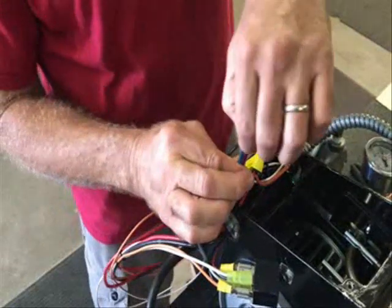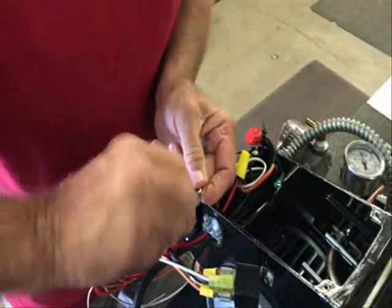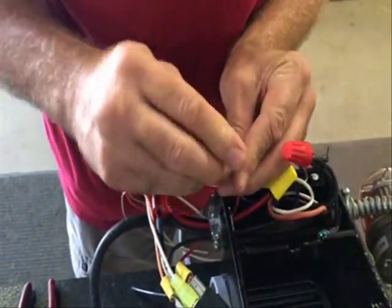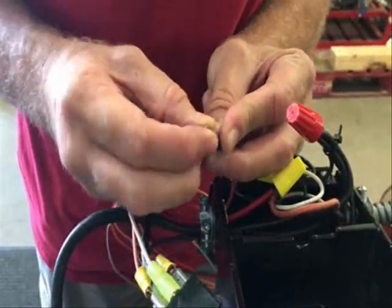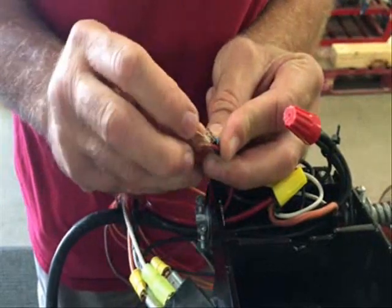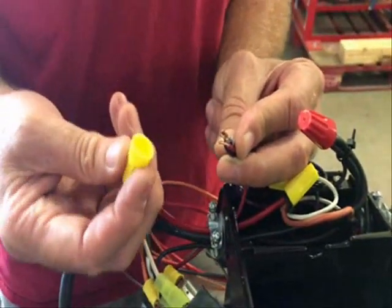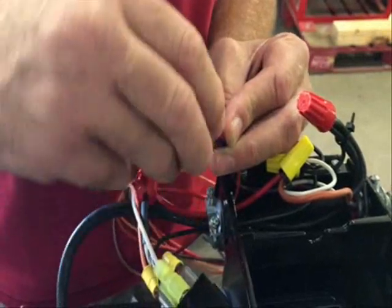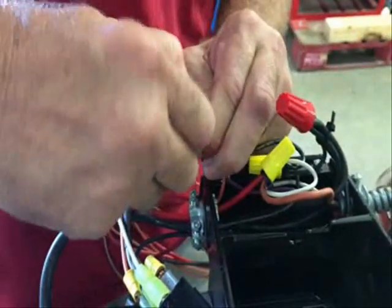When I lazy-loop these wires together in this group, I group them real nicely together at the same length — push that one back, pull that one forward. Make sure the wires are twisted individually — I mean really twisted. It's better to be patient and get it done the right way than to be impatient and have one of those little wires come out, leaving you down for the night. Wouldn't it be a drag to lose a contract because of one loose wire?